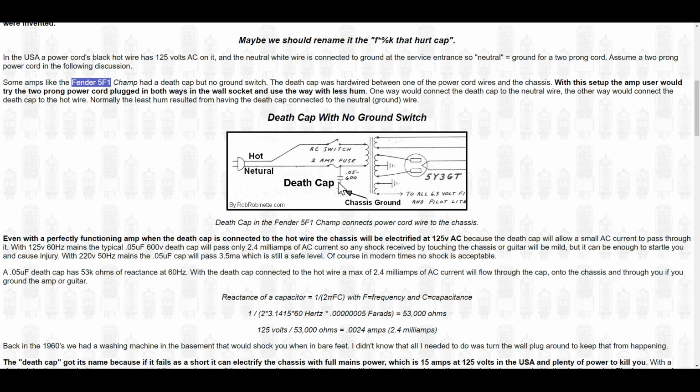So, yeah, black fuse in, out to 3 legs, including the bulb. And the master switch is coming after the bulb. I think I hate that. All right, so that's us, basically. They describe it at 0.05 at 600, and I think we saw ours was 0.047 at 600, and then to chassis ground, and that's what we have here. It's soldered directly onto the casing of all the amp components from just after the fuse.